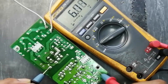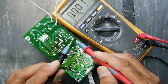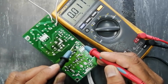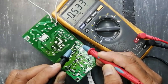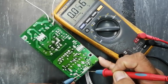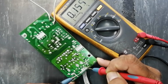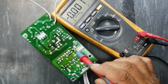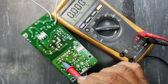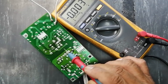Why is there something wrong? It is in the output section. How can we detect it? Set the multimeter to DC and check the output of the optocoupler. It is finding something wrong at the input of the optocoupler — pins 1 and 2 have fluctuation. Check the output: we have output but it is fluctuating. That means there is a short circuit in the output area.